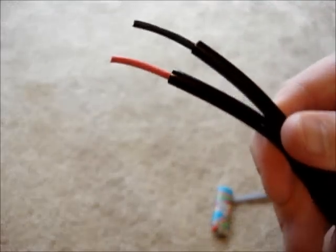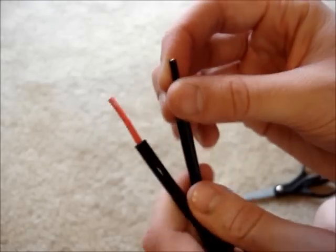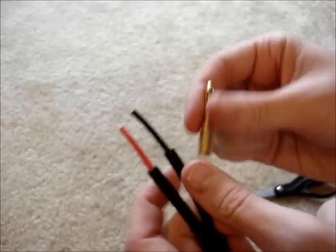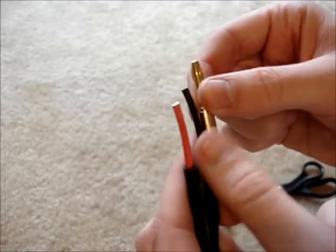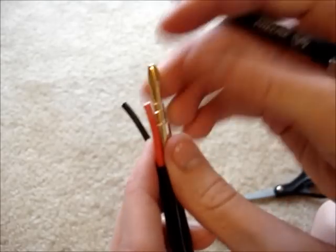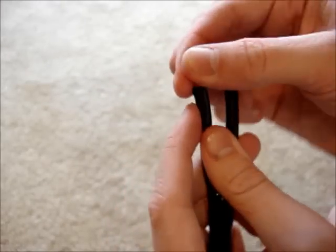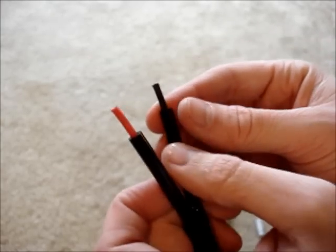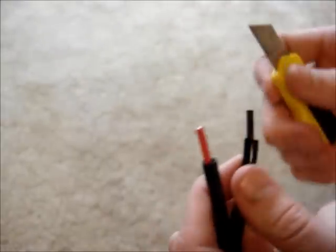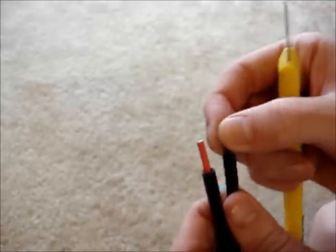Once you get the cable pants on, slide them all the way to the bottom. You can see the heat shrink is completely covered and we have a little bit of extra connector cable for the banana plugs. Unscrew the casing of your banana plug. You can use your felt tip pen to mark where to cut — make it just a little bit below the end, otherwise it won't fit correctly — then splice off that part of the cable. Now strip the outer edge of the individual cables using a razor blade: make a circular cut along the bottom and a straight cut along the edge, then pull it off. Be very careful — the casing is thin, and if you cut too deep you can cut some of the copper wires and reduce the gauge.